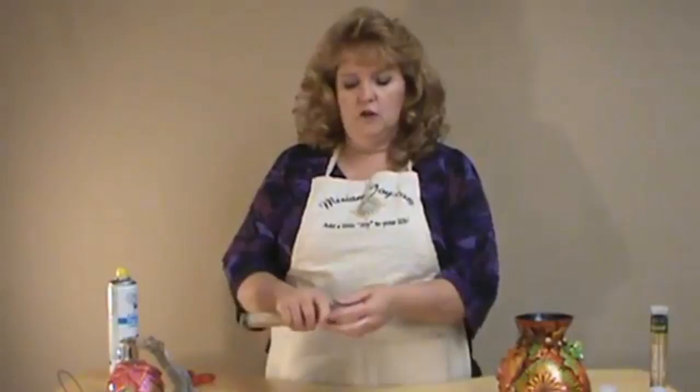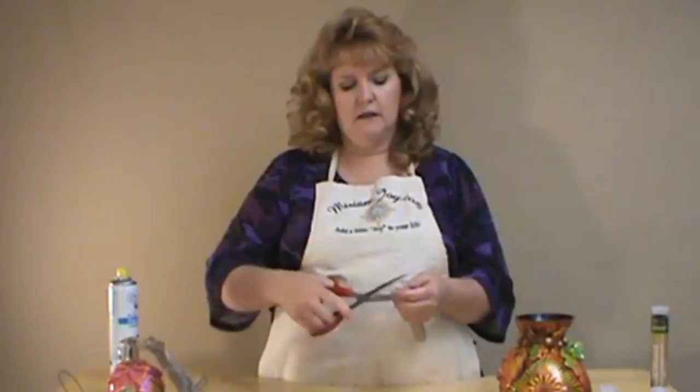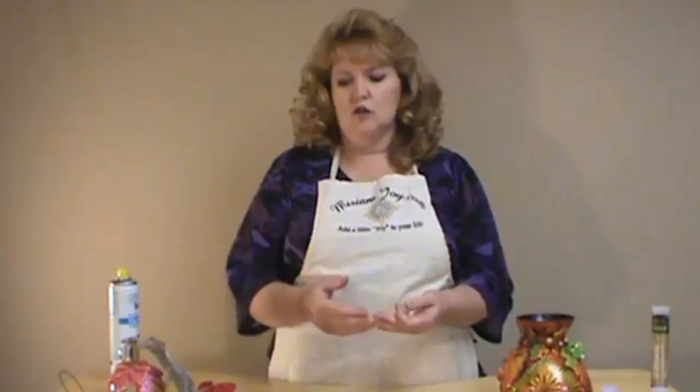You don't want to spray too much vegetable oil on your hands — just enough so it's not sticking to you. One other thing: if you had your Quickwood sitting for a while and removed the little cap and it was a little crusty on the end, just simply remove that tiny bit and then keep on working. The manufacturers tell us that Quickwood has a shelf life of two years, though I've heard of people using theirs for 15 years. So you can keep it around without worrying about using it all at once.